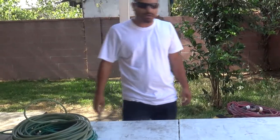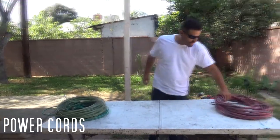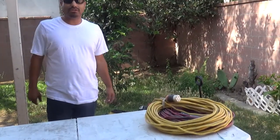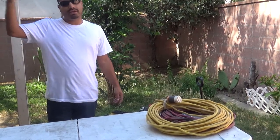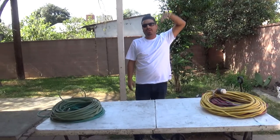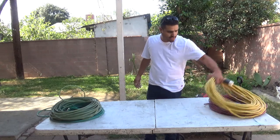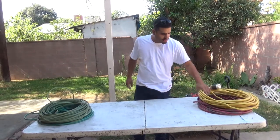Another thing you need is power cords — I got two 100-footers. Same deal: sometimes you only need one, but you gotta have two. Sometimes someone throws a lead, it could be your lead, the company's lead, and you hook up from there wherever you're at — could be up on the roof. Some people carry 50-footers, but usually we carry these 125-volt 20-amp cords for the big jobs.